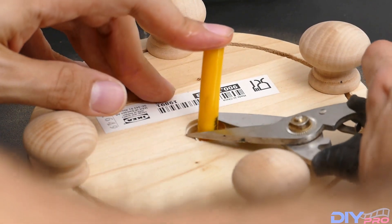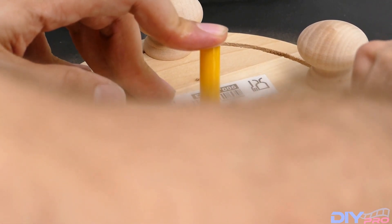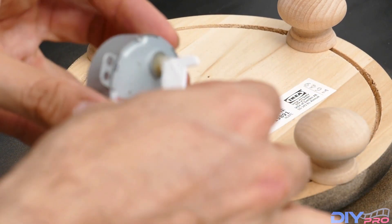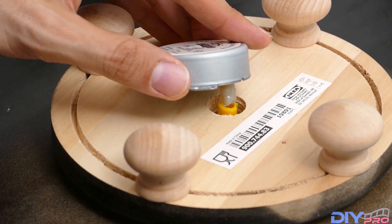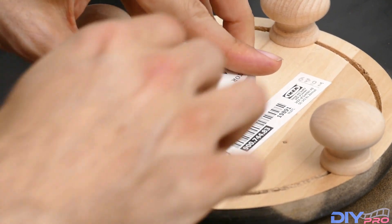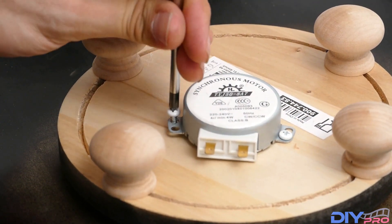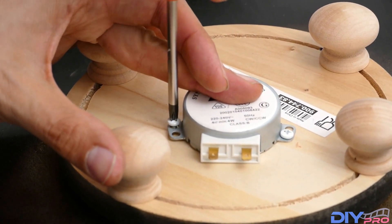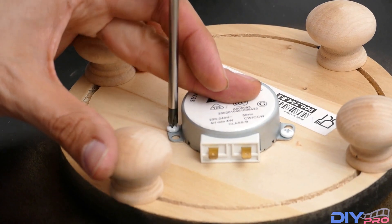Next, we'll cut this pipe as close as we can to the bottom of this plate. And we'll take in the engine — this is an engine that's used for a microwave plate, so it will be wonderful for our build since it's turning very slowly and working on regular household voltage. In my case this is 230V, but you can also find it in 110V, depends on your country. Then just putting a bit of epoxy and screwing it with 4 screws directly to this wood plate. I didn't drill anything before, so it's a screw that also drills during the way.